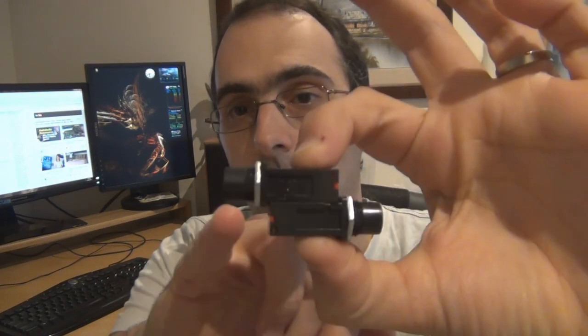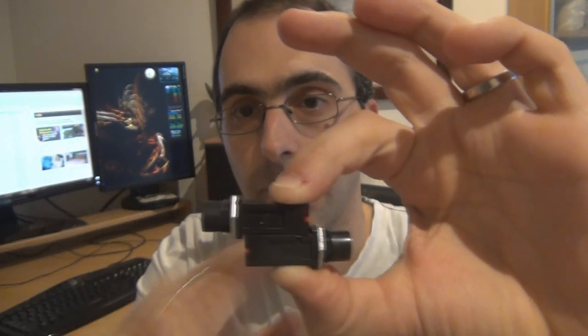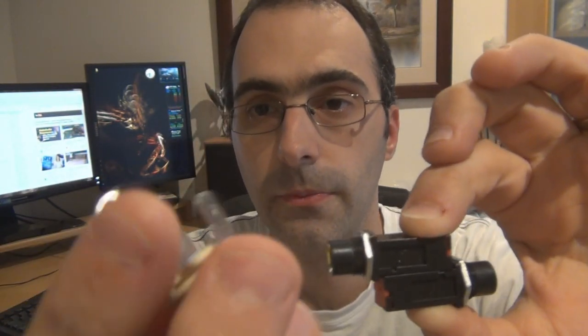So inside the enclosure, it'll probably look something like that, and then you don't have the danger. You can put them nice and close together as well. You don't have the danger, when you slide the guitar cables into both of the jacks, that the hardware will touch, because you've got all these little bits and pieces that hang off the side. Takes up a lot more room, basically. And also, obviously, the main reason is because they are low profile, and the board will sit across the top. It'll actually go over the top of the jacks. You can't do that with an open style jack because they're too fat. So that's how you do that.